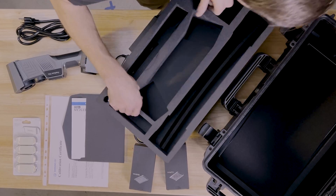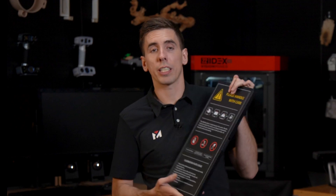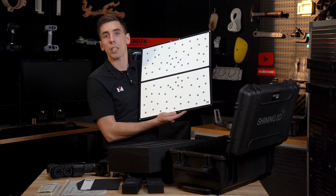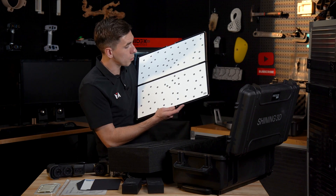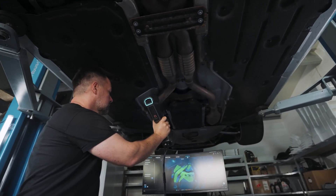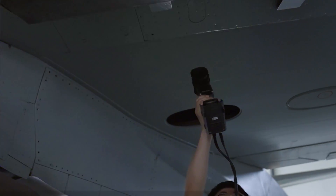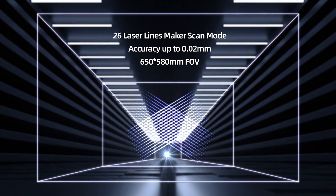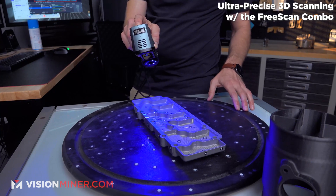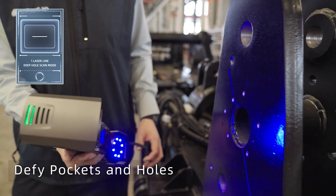Underneath everything you get the calibration board, which is very nice. The outside is black so you won't get fingerprints on it, and it has instructions. It's similar to the FreeScan Combo calibration board with manually placed markers. It also has a photogrammetry mode for scanning super large objects without worrying about scaling factors, plus 26 laser lines and seven lines for super high detail in the partial HD scanning mode — capable of 0.01 millimeter detail — as well as a single laser line for getting into holes and tight spaces.